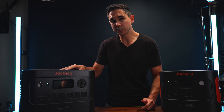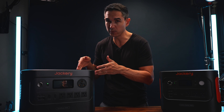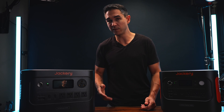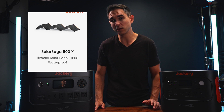The HomePower 3000 can support up to one kilowatt of solar. If you're getting more than two of Jackery's 200-watt solar panels for the HomePower 3000, you'll also need Jackery's connector accessory because you cannot otherwise connect more than two panels without it. You can also opt to buy two of Jackery's 500-watt solar panels so you don't have to deal with connecting a bunch in series, though they're a bit more expensive. The Explorer 2000 can only support up to 400 watts of solar, so you won't need more than two of Jackery's 200-watt panels for that one.